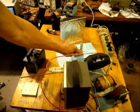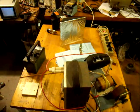I'll stick something in the beam here — it'll just give a pattern. Let me get over here onto the monitor. I'll go ahead and turn on the power supply, and set it first to about 20 kilovolts. Now I'm going to run the filament up and see what happens. Yep, there it is — we're getting some X-rays. We're running about 100 microamps now at 20 kilovolts. I can run it up — I'm going to run it up to 200 microamps. That's 300 microamps. That's a milliamp.